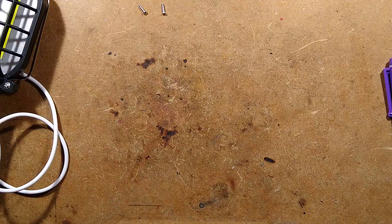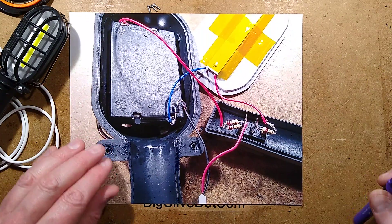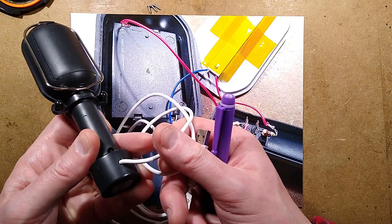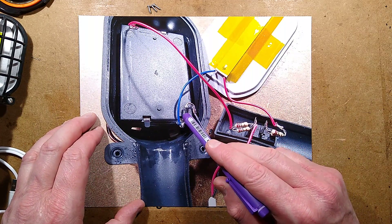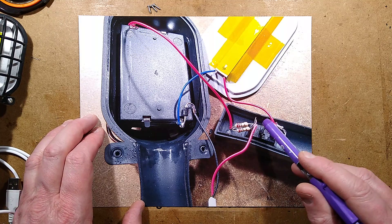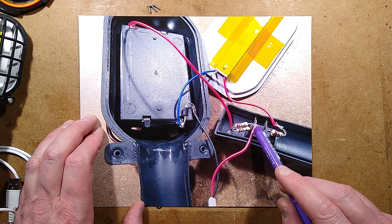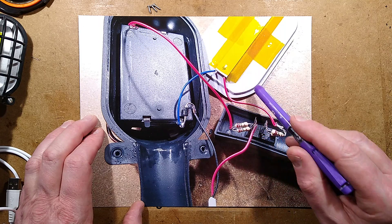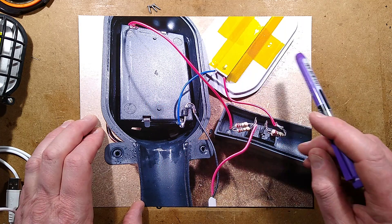I implemented this circuitry inside the light. The USB lead comes in with a cable tie as strain relief, ducting in the back. The magnet in the back is also a convenient park for the connector. The negative goes via the Schottky diode, then to the LEDs and battery pack negative. The switch contact bridges to the LEDs, or when open just trickle-charges the batteries. When power goes off, current flows from the batteries through both sets of resistors across the switch and to the LED array.